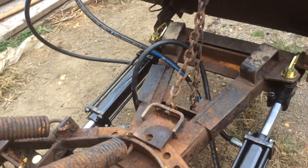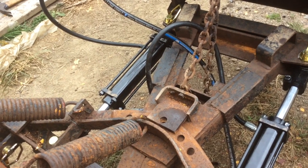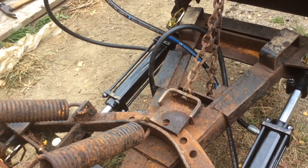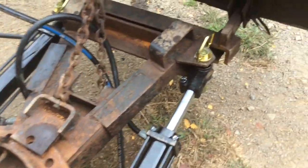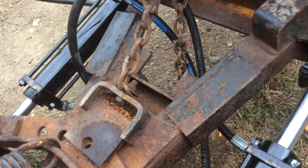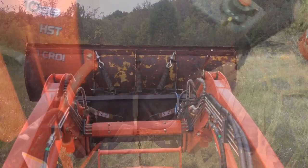I think because I start the hydraulics off and they're in the opposites, they stay synced in the opposites. But they're what I would consider paralleled, because I have the hoses coming out of the third function in the same spot, which is in the back part of the hydraulic back here, and the connection between the two is at the top part of the hydraulic, which is up here, and now it works. I'll give you a little demo of it.